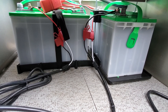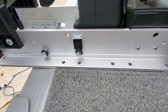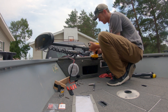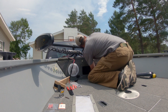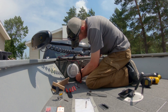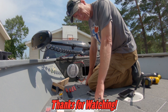This trolling motor system will work much better than the 55-pound. Here's your trolling motor base and here's your holes right here — you'll drop two screws on each side down and put bolts on them. Since my holes didn't line up, I've got to take a quarter-inch bit and drill two holes. And it works! So that is how you, in a nutshell, wire up a new Minn Kota motor, put in batteries, and go from 12 volts to 24.